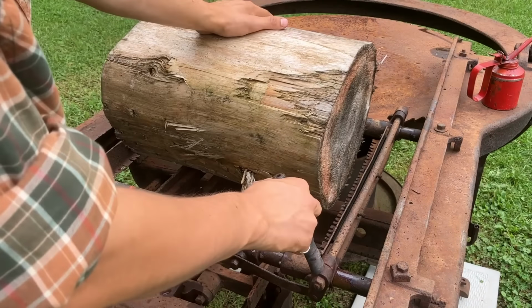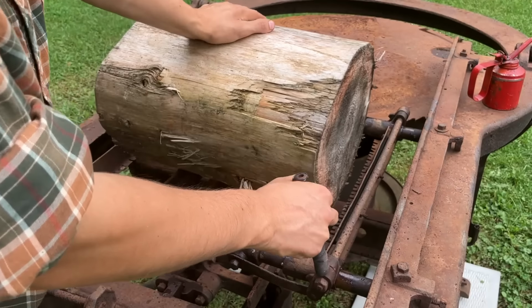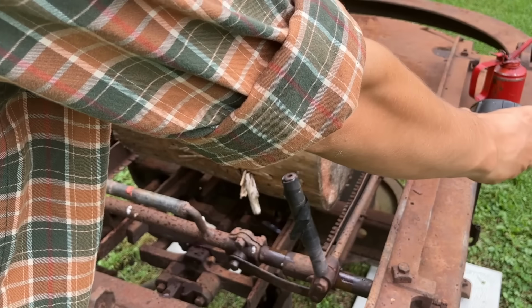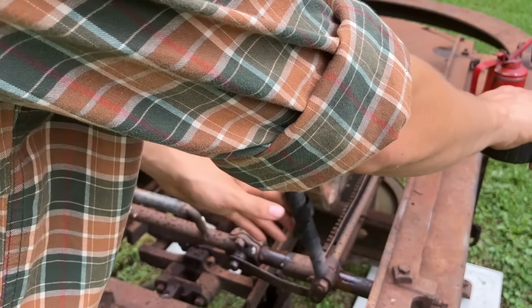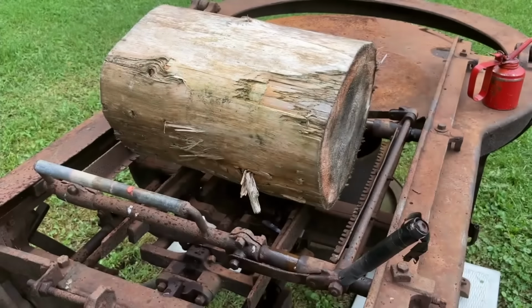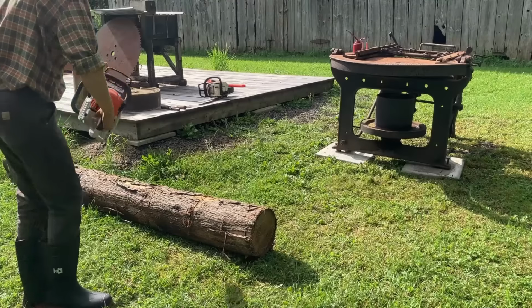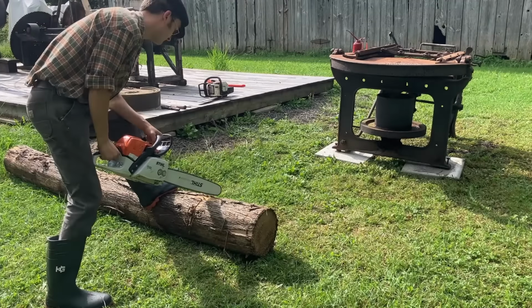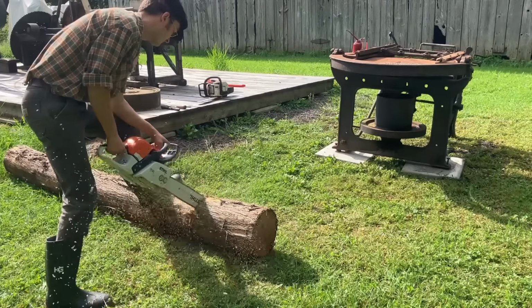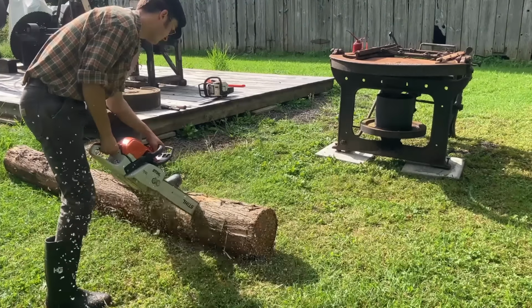And here's the carriage. The blocks that we use as standard on the automatic and swing shingle mills that we already have are 16 inches, but for whatever reason, this mill's set up for 17-inch blocks. So in the future, I'll just adjust that. The bolts were pretty darn rusty, so I let them sit in oil and just go ahead and cut up a couple 17-inch blocks for experimenting here today.